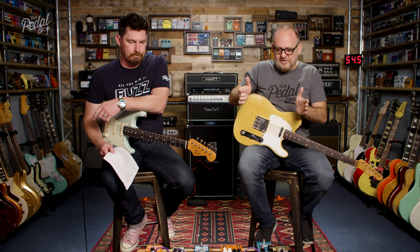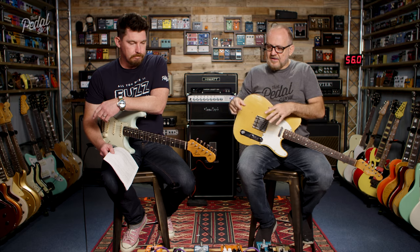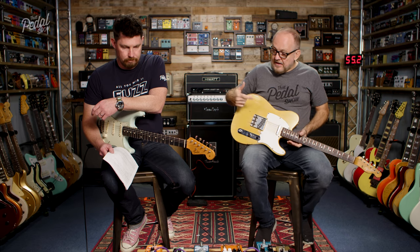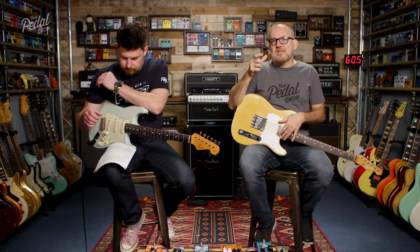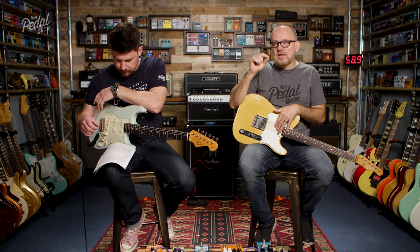When these original pedals were designed, they were designed with germanium transistors. And the design of the pedal in particular means that the input of the pedal wants to see the coil inductance from your pickup. It has this relationship with the output impedance of the guitar and the input of the circuit. So it actually has what we call a low impedance input. Normally, if you take something like a Boss pedal, it has a high impedance input, which means it's easily driven by anything. And it has a low impedance output, which means the output will drive the signal.